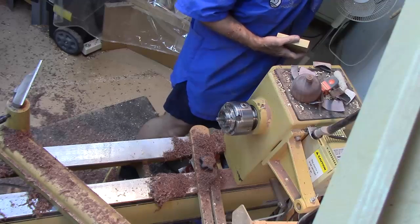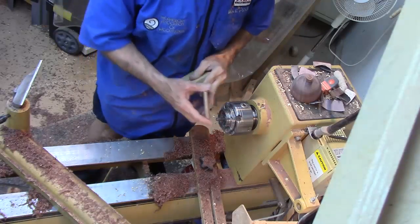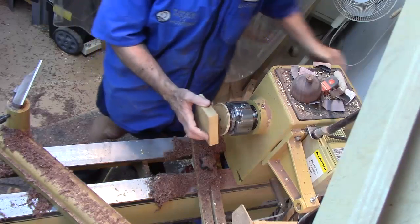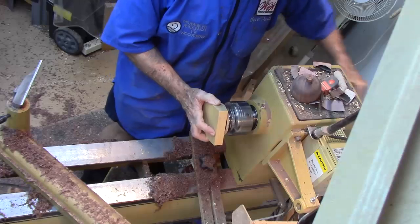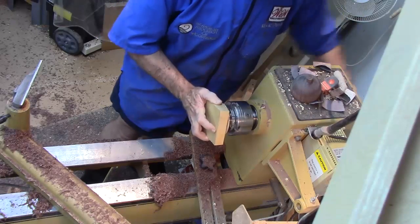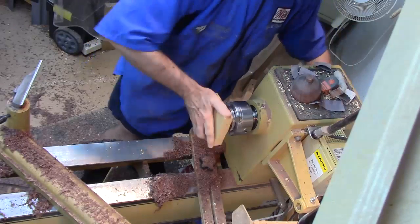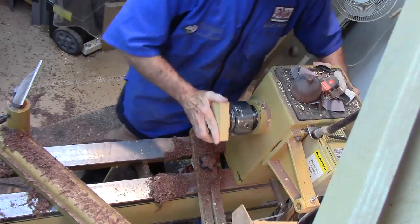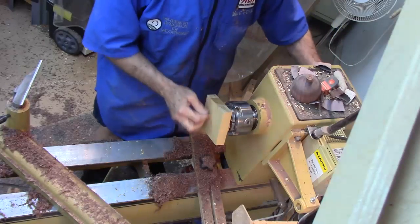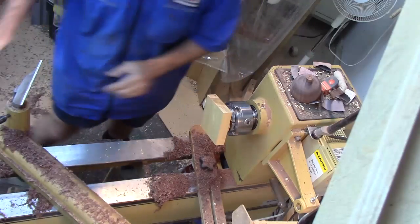We've got a 1/4 inch shim we're going to put on here. This protrudes about 3/4 inch, so this winds up doing just fine. And this is the initial mounting. In order that we can do a recess on the bottom that we're going to use, we'll go ahead and finish the bottom now, put that recess on it, do a little decoration, then use that chuck to hollow the other side.